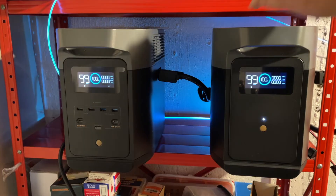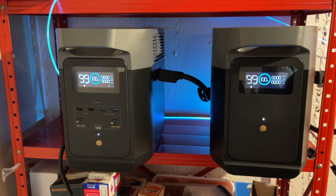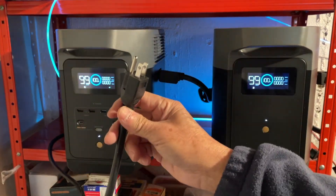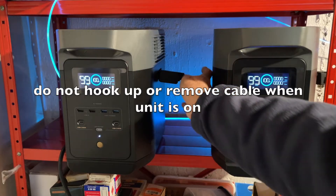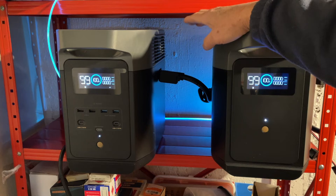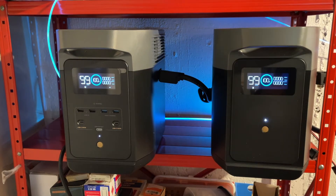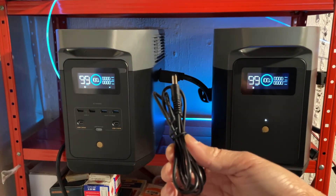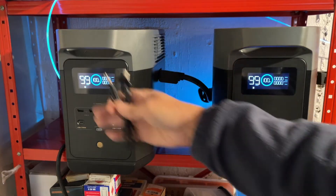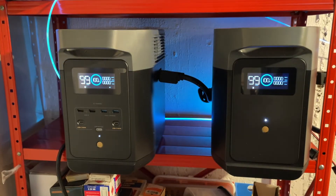With the extra battery there's no cooling fan, so on that side you don't have a problem. In the back, you have to allow some space. I would connect whatever cables you need first — hook them up to the back — because it's difficult to pull out the unit with this big cable attached. The AC connections are in the back, along with some of the 12-volt and the solar input. So hook up all those wires first so you have access to the charging and those barrel connectors. You won't be able to see what's in the back unless you pull the unit out.